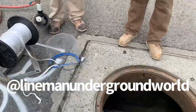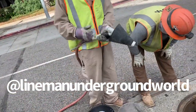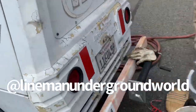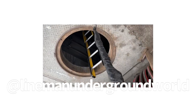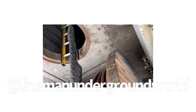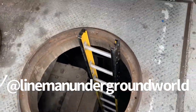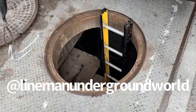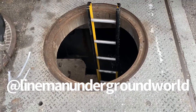Alrighty, stand by. Everything's squared away. Got the gun all ready. Lock and loaded. Yes, sir. Lock and loaded. And we're gonna juice it up. So we came back over here, and we're not gonna do a pull through after all, because the conduit doesn't go. What we're gonna do is just put the cable over the hole and float it down so they can pull the short span of about maybe 100 feet. So that's what we're gonna do instead of rigging up. We're just gonna float the cable and pull it through.